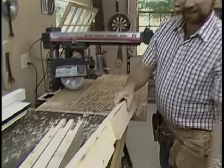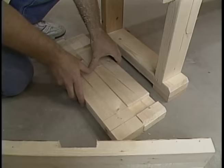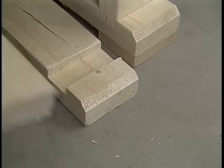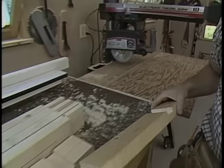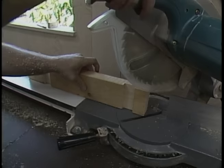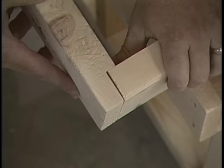Okay, that's our four legs. The next thing I want to do is make a couple of feet — this piece right here. That helps stabilize the bench. I need to make a half-inch deep dado so that my leg can fit into it, so back to the radial arm. That takes care of the two feet, but I want to knock off this sharp edge by chamfering it so I won't stub my toe walking around the bench. I'll do that on the miter box set at a 45-degree angle. But while I have the dado head set up in the radial arm, I want to make this end piece for my tool storage area and make a rabbet joint in that, which gives me a real strong connection.